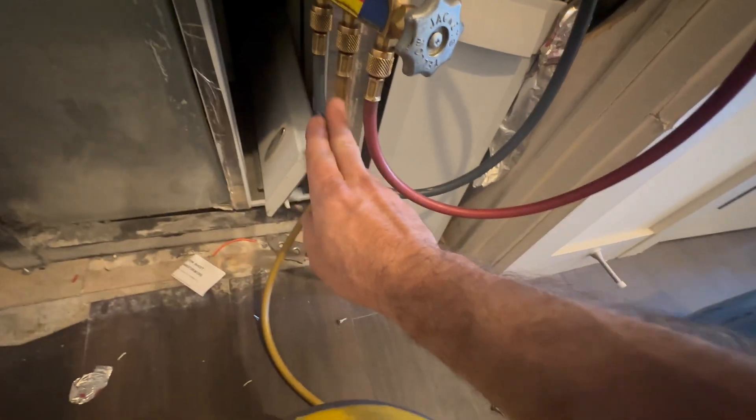I'm going to open both valves — I need to get all of the air out of this. My plan was to cut all these out but I only have two fittings. I'm going to sweat this last one out and put a wet rag behind on top of that water pipe.